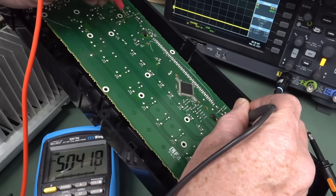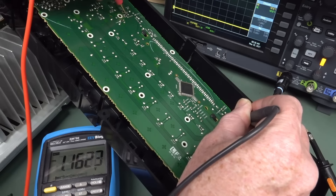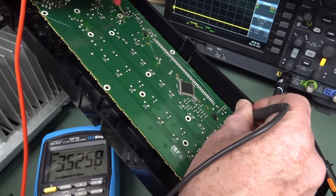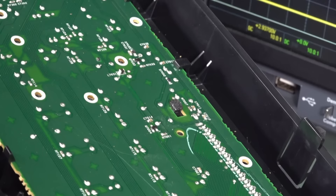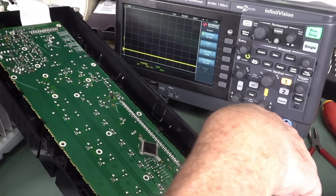This is supposed to be a 3.9 volt Zener, and it says 3.9 volts on the output. Well, you're going to get your PN drop in there. I'm not sure what the deal is there. But let's measure that rail — it's our 5 volts input, as we expect. And we're actually getting the Zener voltage — that's 4.2 instead of 3.9. I'm not sure why. Who knows? They might have changed the part. We might have an out-of-date schematic. Anyway, let's measure the 3.5 volt rail instead of 3.9. Whether that makes a difference, I don't know — but that's kind of like the drop you'd expect. It's not zero.